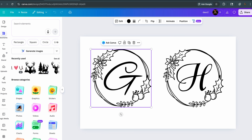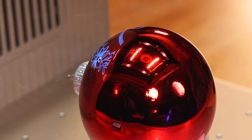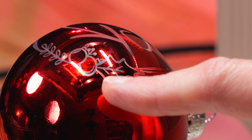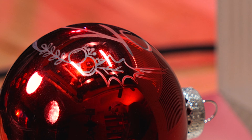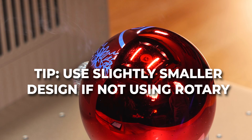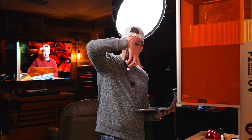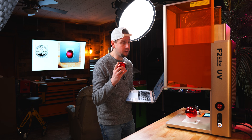I am engraving both the front and the back. I already engraved a test piece and the design was a little too big — the engraving did not take on part of it. The biggest tip: if you're not using a rotary, you have to make your designs a little smaller, because when the beam hits the side of the sphere it's going to refract. But since I tested speed and power, we are ready.